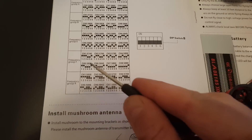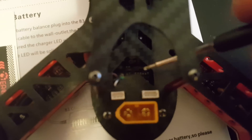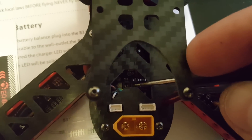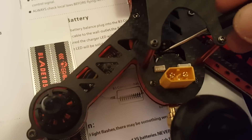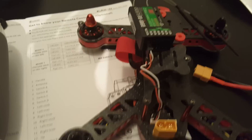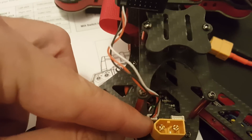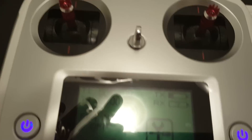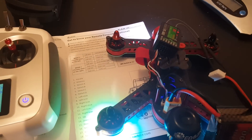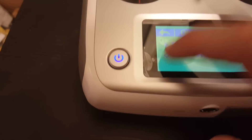In the attached booklet you can see the diagrams on how to configure your transmitter. Just one thing to note — the diagrams are reversed, meaning when it shows black on top in the booklet, it's actually white on top on the drone itself. On the left side is the PPM port, which is the same. To connect the receiver, plug the PPM cable into it. You have to make sure that the remote is in PPM mode — go to configuration, scroll down, select output mode, and choose PPM. Otherwise you won't be able to connect it properly to the drone.